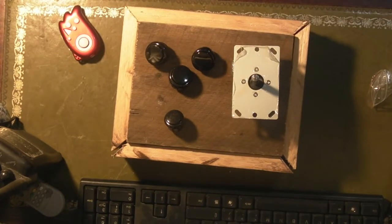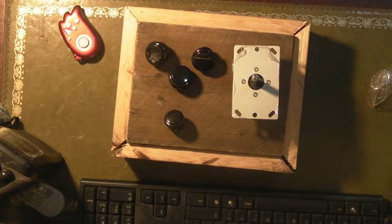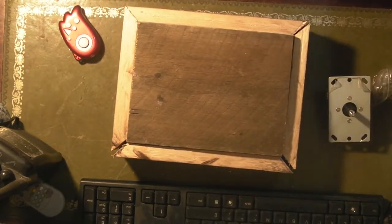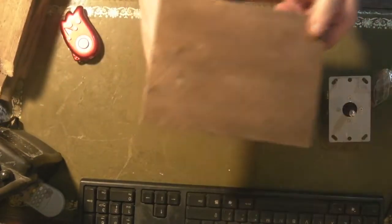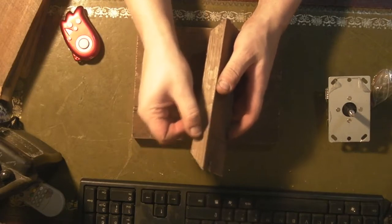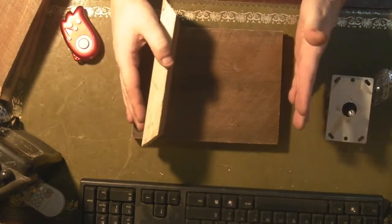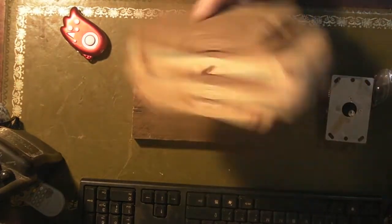Once it's all built up, I'll do the sides nicely — I'll use my router to put some nice molding on the corners, then sand it all and wax and polish the box to make it look really nice. On the bottom of the side pieces I'll put a step with the router, probably about three-quarters of the way down and a quarter-inch deep, so I can fit a base with feet — that way we can easily access the insides.